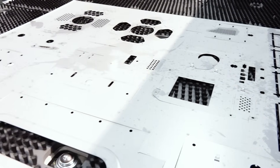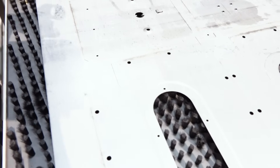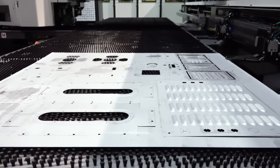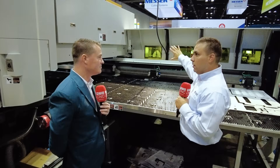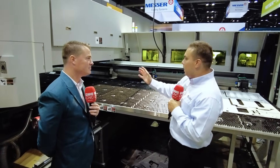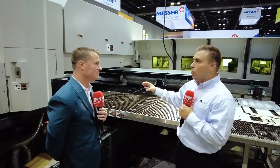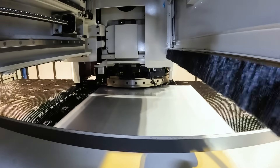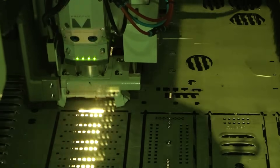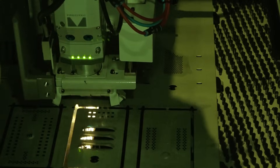The final cool thing about this machine is that our 33-ton design is a two-piece design. We're hitting with 33 tons of force on the punch press and we have a 50-to-60-micron beam on the laser head. If all that vibration transfers from the punch across to the laser, we're talking misalignment and serious issues. By having a two-piece design where the press frame is separate from the table, we can disengage the press frame and table from one another while punching — keeping all that vibration restricted within the press frame. When we laser cut, we re-engage, so we still get our accuracy, our flying optics, and a consistent laser process.